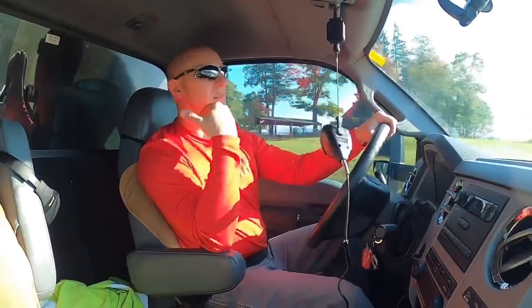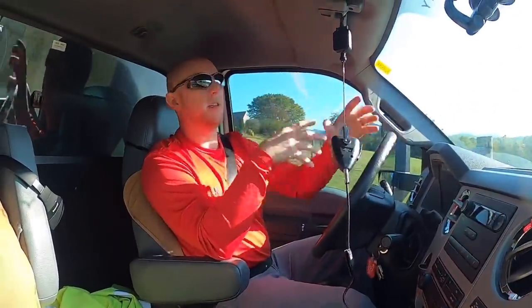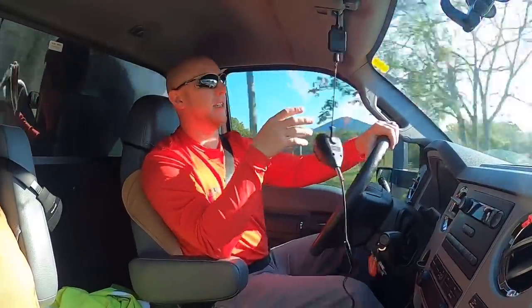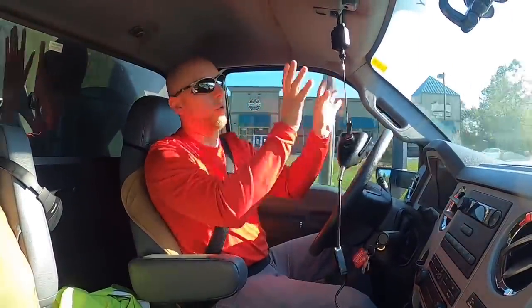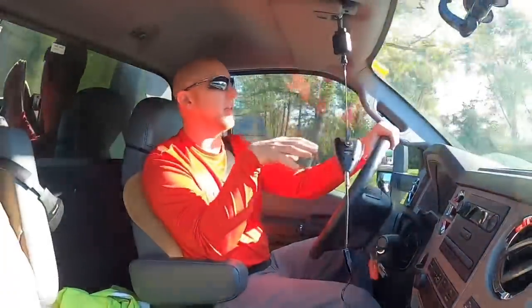I suggested to just do about every 10 to 15 feet a little riprap to break and slow the water down and collect silt, and then just once in a while, as silt accumulates, he can just shovel it out up onto the bank instead of it just being a full washout and all that silt washing into a culvert,